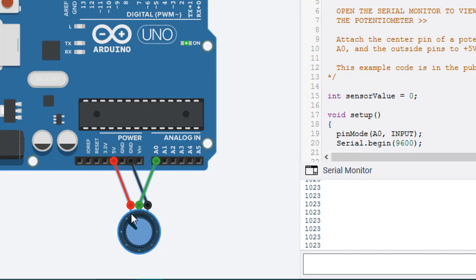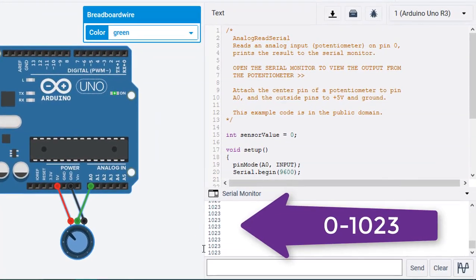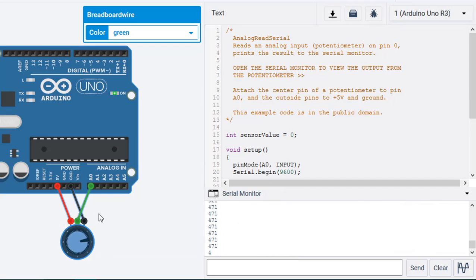As I mentioned, the particular pin has a 10-bit resolution. The default analogRead resolution for all these Arduino boards is 10 bits, and we can change it to 12 bits, but we are not going into that right now. A 10-bit resolution varies from 0 to 1023. So initially it is 0 and now it is 1023. Initially it is set to 10-bit resolution, but we can change it. I am not going to change it right now because there is no need.